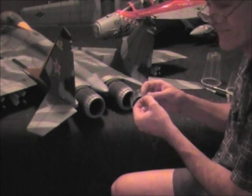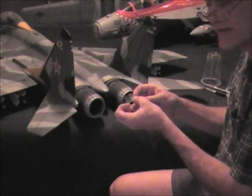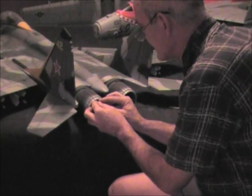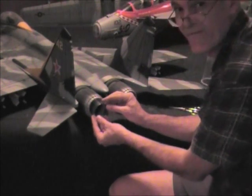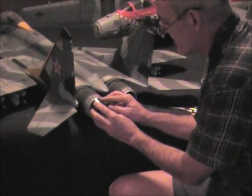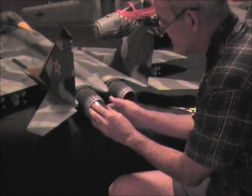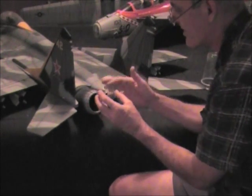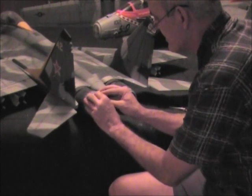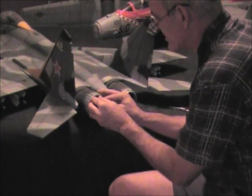This is still rough cut out, and I'm probably going to shave off a 16th, 32nd, or even a 64th of an inch, just because I've rough cut it with my razor knife. Now I'll just take this and slightly fit it in there. If you gently take these, you can actually kind of fold them a little bit without creasing them to get them to fit in the thrust tube, since the wider part is the back side here. And you want it to fit in real nice and snug so that you can tape it in place.